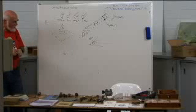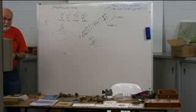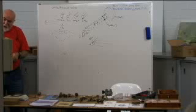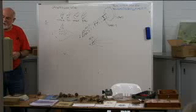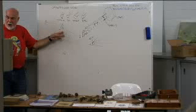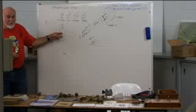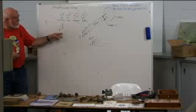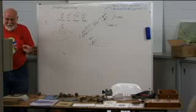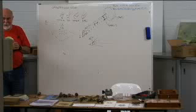And it's one of the reasons that most engravers like to work with copper of no less than 1 millimetre thick, because that gives them that little bit of extra thickness to fix any little mistakes. But I might add that often the mistakes that occur there are only microns deep. They're not really, really deep, and they're very easy to remove, especially in copper. It might be a little more difficult if it was stainless steel or titanium, and especially if it's a watch back in stainless steel. So you just make sure you don't make a mistake. You go very, very carefully.